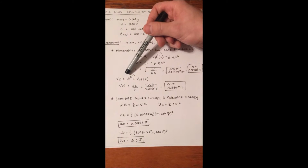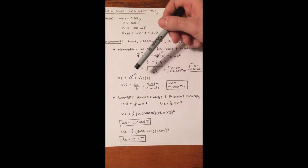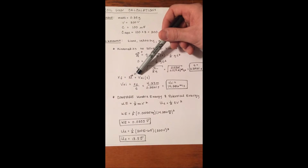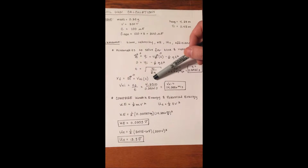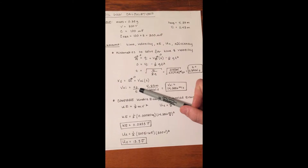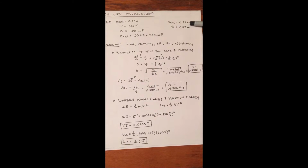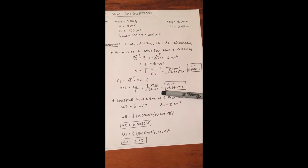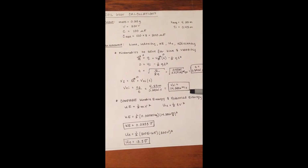Then we go to our kinematics equation for the x, and we get x final equals x initial, which is going to be 0 because you set your coil gun to be the 0 distance at the start. Then you add the velocity in the x direction times time. So when you solve for the velocity in the x direction, you get that equals your final x distance divided by your time. We got our average final x distance to be 4.23 meters, so we divide that by our time from the first equation, which was 0.2961 seconds, and we got that to be 14.286 meters per second.